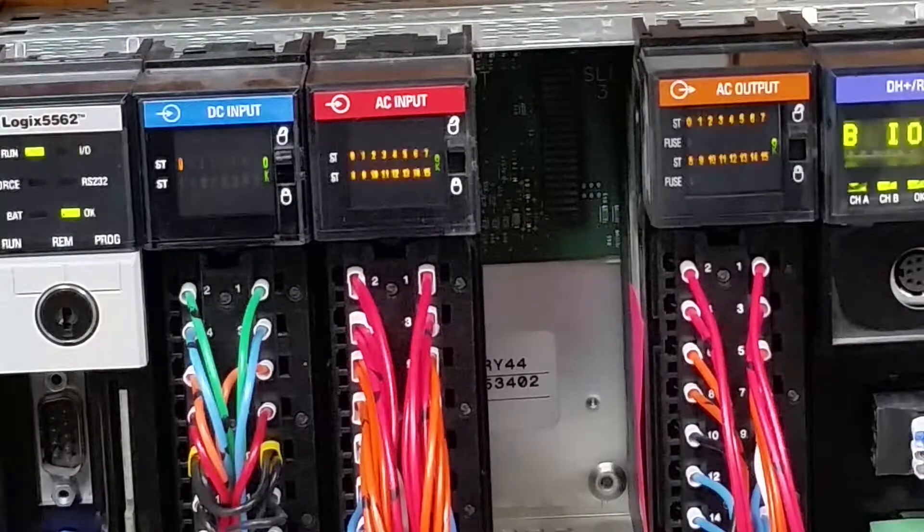Now it's output one. You can see how it was staying on when the others were off. We're starting to get other little things going on if you watch the input. That shows this has got at least one, if not four, flaky triacs in it. This is not something you're going to see very often, but it shows the value of testing more than just a couple of times. You can't just test with an ohmmeter or tie a voltage meter to it to see what's going on and off — you actually have to give it a little bit of time.